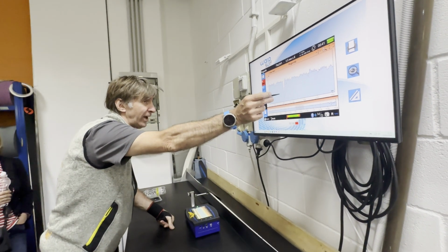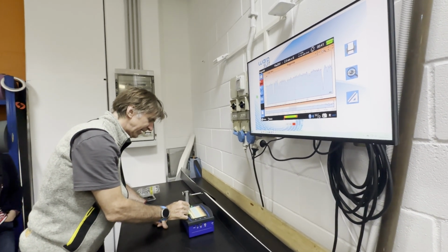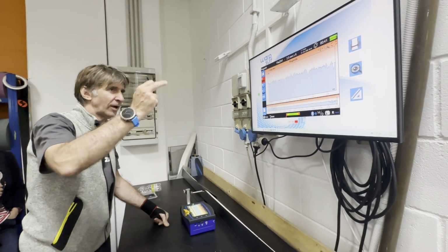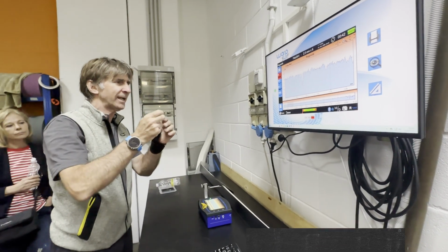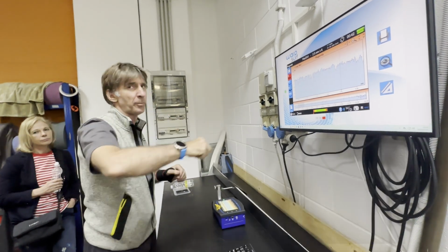The second detail he measures is edge roughness, which is basically how smooth or coarse the metal edge is. The smoother the edge, the less drag it creates and the better it grips and glides. With his tuning machine, Daniele produces edges 15 times smoother than those sharpened manually.